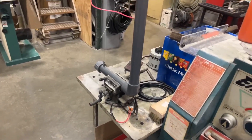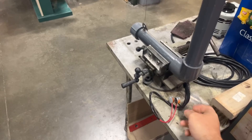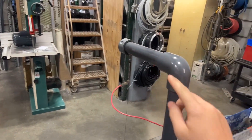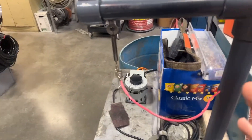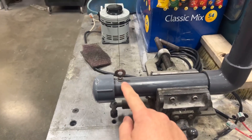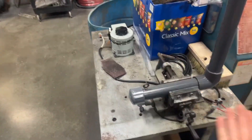If you guys want a video about actually making this thing, we can go ahead and do another one. I'm not going to tear this one apart just for the sake of argument. But if you can see here, I have two wires going through a U-shaped PVC frame. I use Schedule 80 just because that's what I had — any kind of PVC will work, just something insulated. I have one wire connected to this washer that I TIG welded onto a quarter-twenty bolt, or you can use an eye bolt — anything — whatever it takes to get this circuit working.